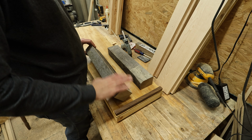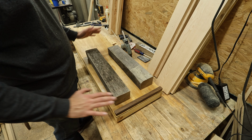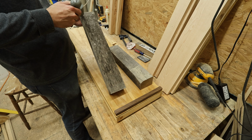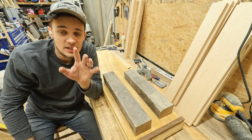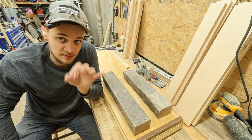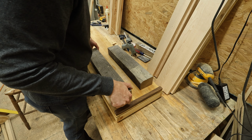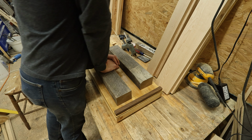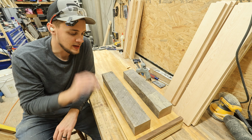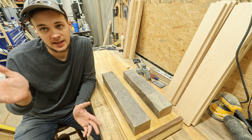So in this case, I'm going to take my hot glue and put four globs, one here, one here, one here, one here. By using those globs of glue, if you do it right and use enough, that'll prevent the need for shims, because you set it down and put just a little bit of downward pressure on it right where you know it's contacting the wood, so we can make sure that's good and tight to our sled. That glue will fill the gap and harden under the edges that are not touching.